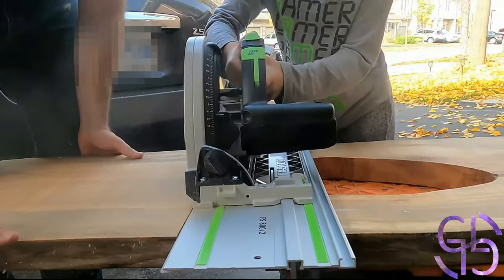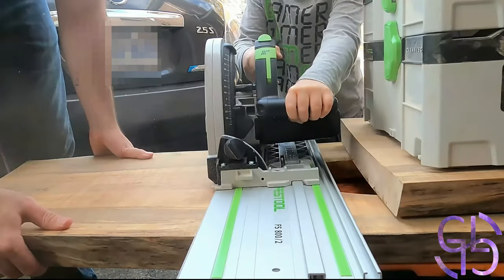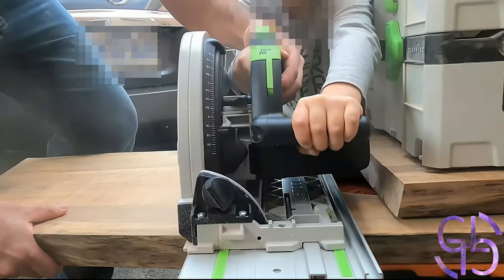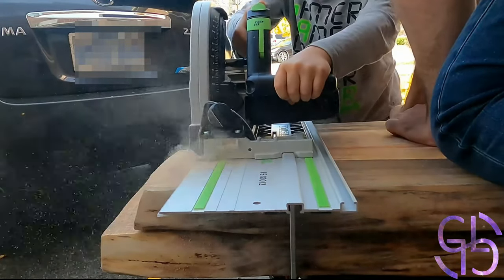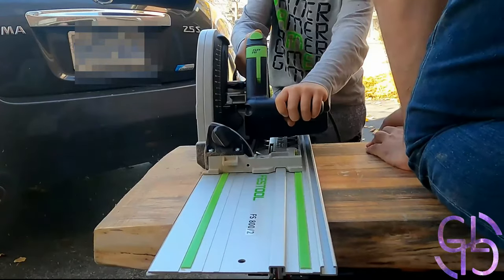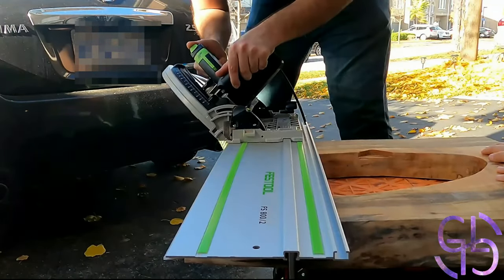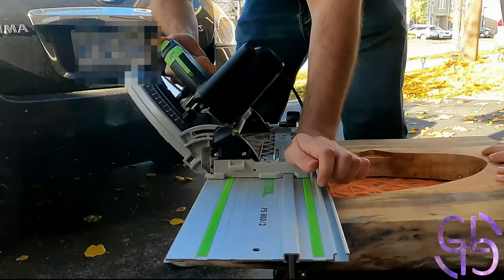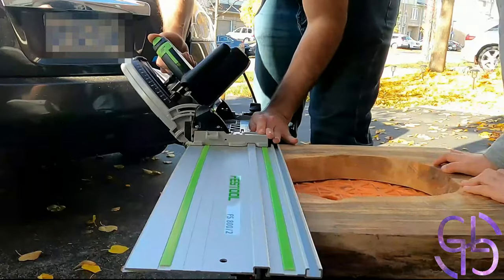After waiting 9 weeks until humidity of the wood hit 7%, it was time to turn it into a table. At this point we were still not sure what to do with the hole. It was horribly large and to be honest I had no idea if it could be salvaged. So an idea of turning it into a chess table was proposed and that's what we did. The original intent was to make it into a coffee table like the one I made, with the chessboard in the middle. However, I was concerned about the table not being structurally sound due to a giant hole cut in the middle — it would fall apart under all that weight. It was a bit thicker than 2 inches and a very heavy slab. So we decided to cut it into 3 pieces and use corner pieces for legs.